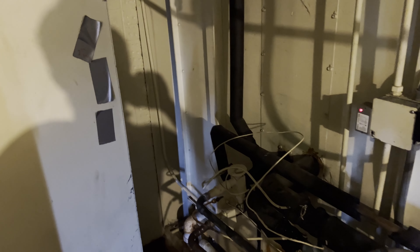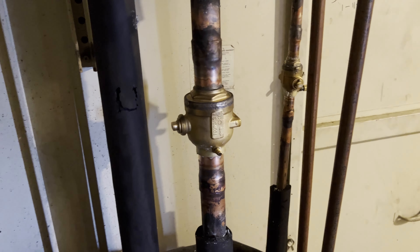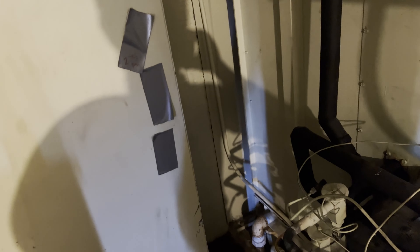What's up YouTube? This is going to be a follow-up video to my most recent video with the isolation leak test. Fixed a leak there. Left it on 275, and we're still on 275 PSI holding. So I'm going to go ahead and switch my gauges over and we're going to pressurize from the condensing circuit.